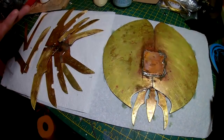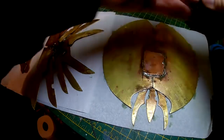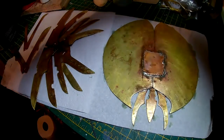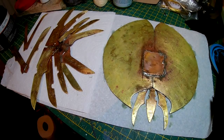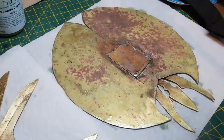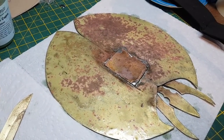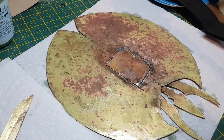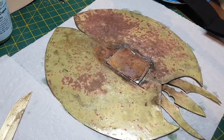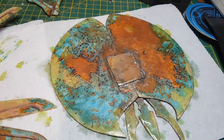To get further variation in colour I've also taken to getting some wire wool and scrunching it up above the piece. That causes small pieces of iron to fall onto the metal, which then rust along with the brass. What you get is a combination of brown and green which can lead to some very nice results. The wire wool starts corroding very very quickly — by the time I'd just changed the camera angle you can already see it going reddish-orange. Here's the time lapse over a couple of hours of the metal corroding — you get some very vivid colours, so it is quite fun to experiment.